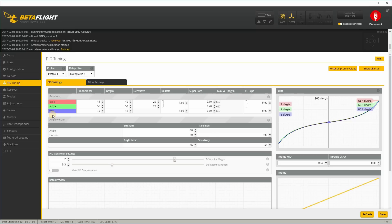I'll turn off telemetry, turn off black box, turn off transponder, and turn on air mode — that's it for this page. I'm not changing anything on fail-safe. These are the stock PID settings and I'm pretty sure I'll need to bump these up. I'm going to go with something pretty high — let's say 70. I'm just guessing at this point based on some numbers I've tried with other builds that seemed to work okay.